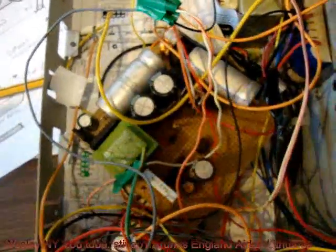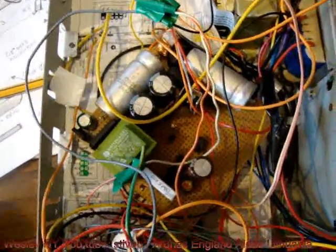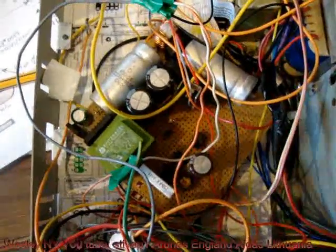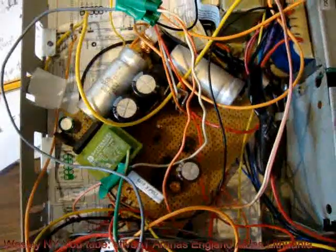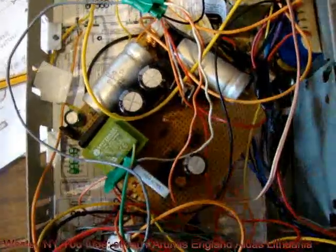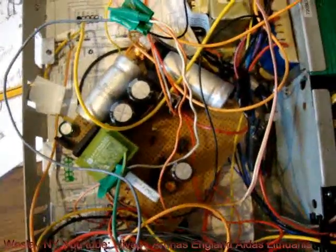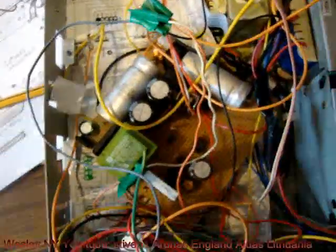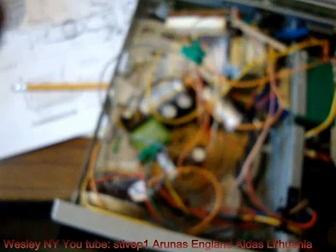Then you put the Encyclopedia Britannica on the bench, that is equal to power consumption without the load. You estimate the amount of energy used when you have the Encyclopedia Britannica in your hand, and now you see the difference. The difference is 15 milliamps, which stands for approximately 3 watts, if I remember correctly. It looks like we have approximately 3 watts in, about 100 watts out.